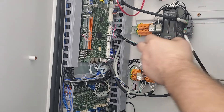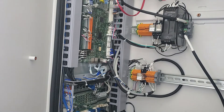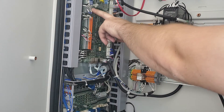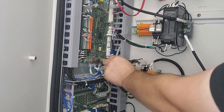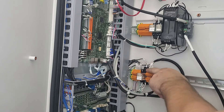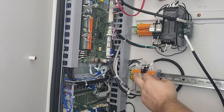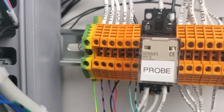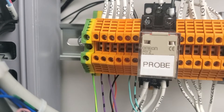If we look in our cabinet, we've got our XTI and XTO board where we have our outputs going in, and then our XTIO A and B where we have our skip signals wired. We have our OMI cable coming in here going to a couple of terminal blocks, as well as our relay. We're supplying 24 volts and ground, and the relay is swapping between our skip signals.